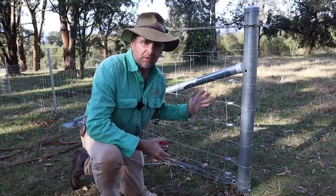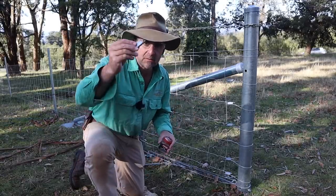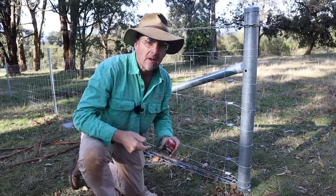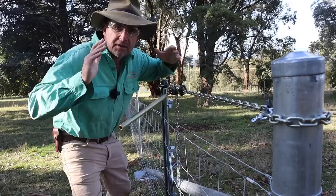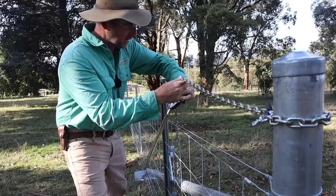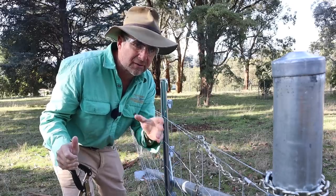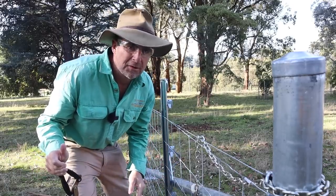So there you go — the fence is strained up nice and tight. Even the last foot or so has really good tension on it, either because we used the MaxTensor with its application tool, or because we used crimp sleeves with the fence fixer. Links to all of that equipment are in the description below, so you can choose the method you prefer. So now it's just a case of easing off our strainers, and as you can see, I've lost less than a link of tension using the method of straining to the end post that I've used. It is really well worthwhile using the right tools to get this job done, because your fence will be nice and strong for a long, long time.